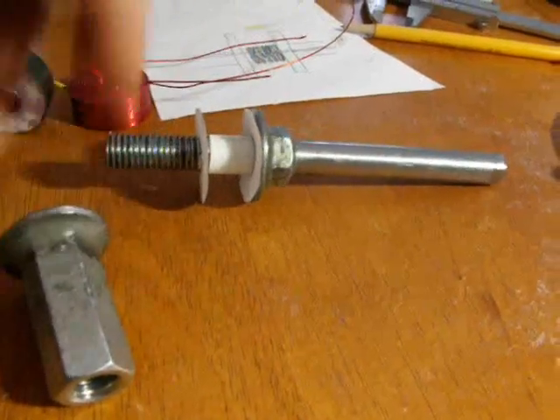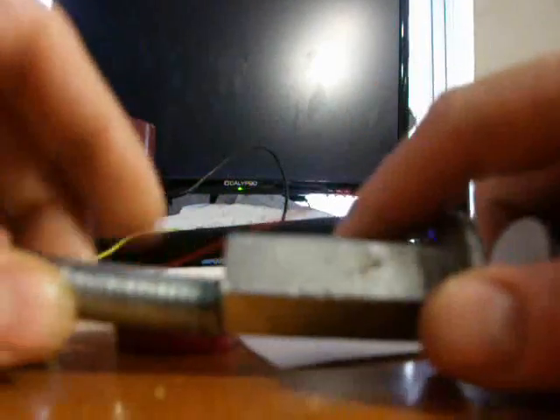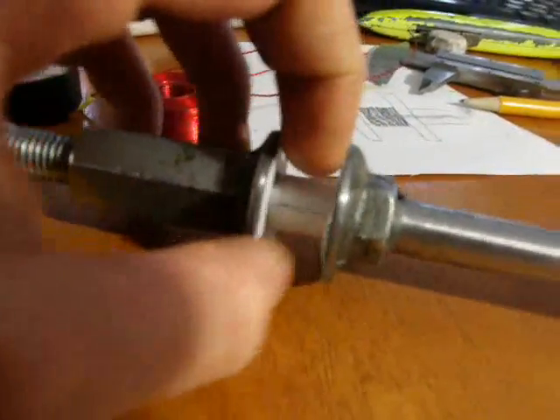The coil will be wound here. To make the distance between the washers precise, I screw the fitting in and then measure the distance between the washers. When it's correct, I insert the screw and jam it in place with pliers to make sure the gap holds without any disturbances. During winding there will be force pushing the washers outward, so you need something to ensure the nuts won't rotate and the gap won't change.